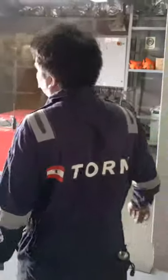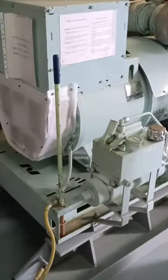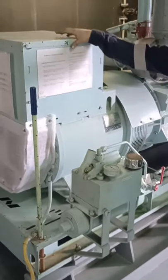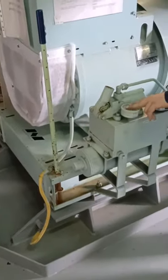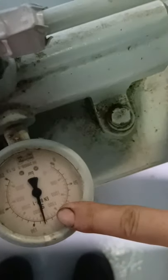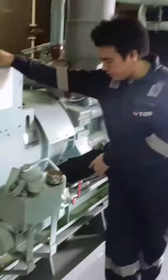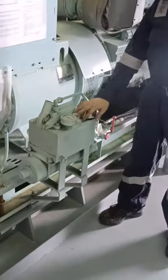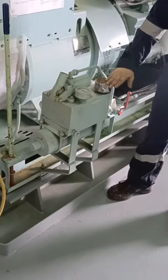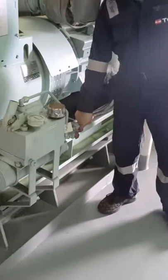This is the manual type — the hydraulic. We'll use this hydraulic. It is written here that we should have 135 bars. We need at least 135 bars. Just put it on manual, then we will try this hydraulic starting. So 135 bars, then this lever should open.